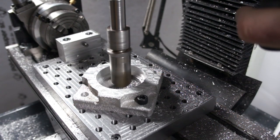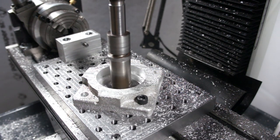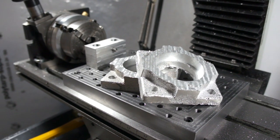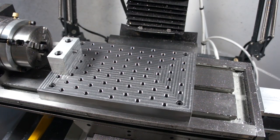Once the bearing race was done I just went ahead and milled out the bottom, just for cleanliness honestly — make it look a little better. You won't see that part anyways, but that's the finished part. Next is to cool the bearing races and drop them in. I might heat the mounts here, but next week we should have it all bolted up. Thanks for watching. Bye.